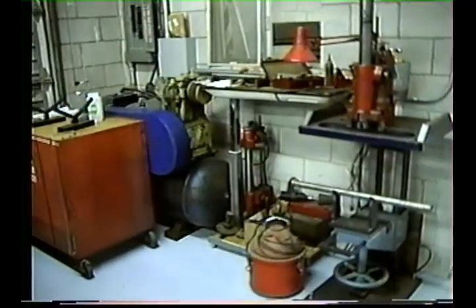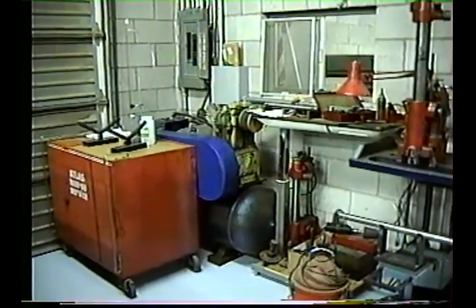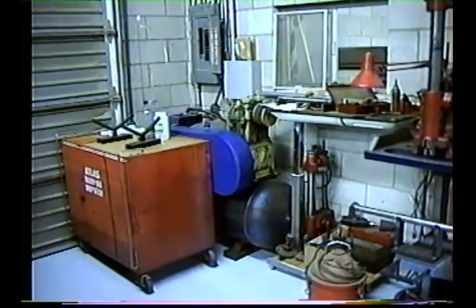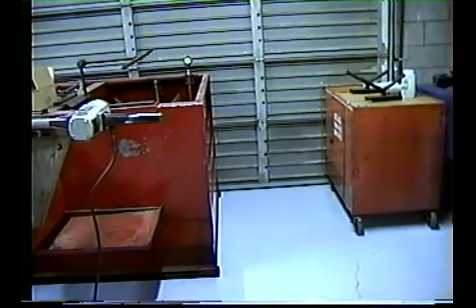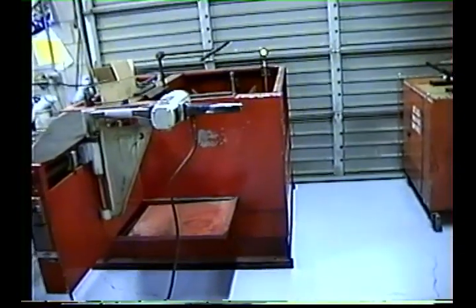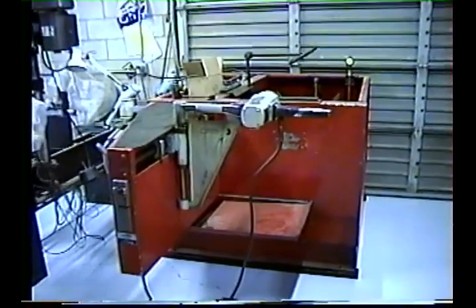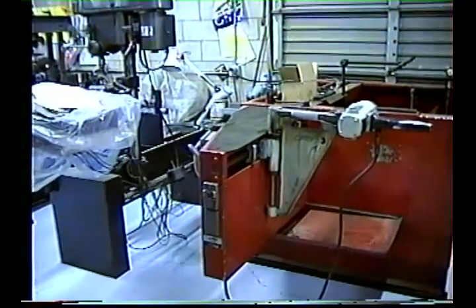and we're into the CC department, where we CC out all our cylinder heads. There's equipment for our high performance head work. Line honing machine, where we do the line hones for all of the blocks that are to go into race cars and high performance stuff, and on into the balancing department, where we do all of our own engine balancing.